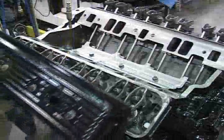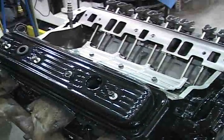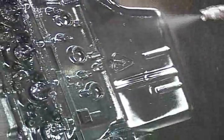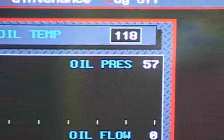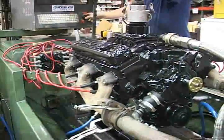Every engine is further fit with appropriate tinware, such as spotlessly clean valve covers, timing cover, and oil pan. A water pump is also installed prior to the application of the distinctive black MerCruiser paint. After final assembly and painting, engines are pressure tested to ensure water jacket and oil cavity integrity. And then the final and most important quality assurance measure is hot testing.